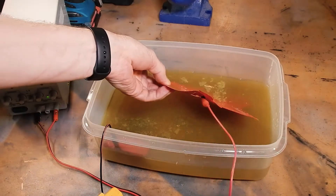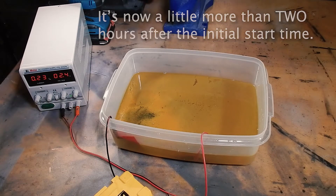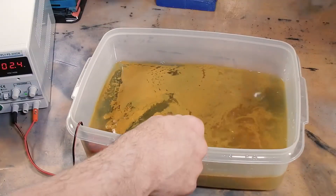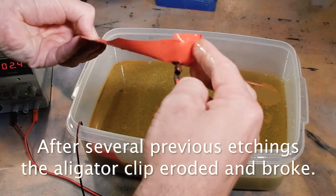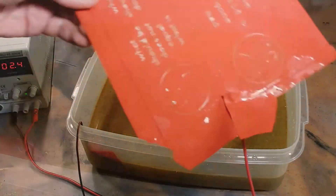We're back down, it's about 2:25 - an hour later - and we've definitely got some more going on. It's definitely deeper. My wire has gotten screwed up so I had to fix that. I made a quick repair to the back - I just cut that alligator clip off the end and taped the wires directly to the back with some decent tape, and I hope that'll get me through the rest of this etch.